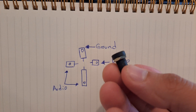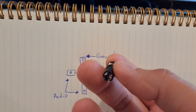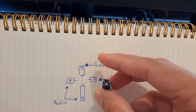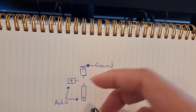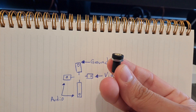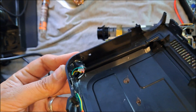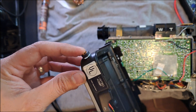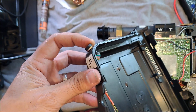Now, to output a video signal, I'll be using this four-pole connector. Each pole will be soldered to a wire on the camera's motherboard: one pole for video, one for ground, and the other two for the left and right audio channels. However, this camera only outputs mono audio, so I'll combine the two audio wires into one. I followed the same procedure as with the battery connector and installed the audio and video connector on the other side of the camera's casing. It looks neat and clean.